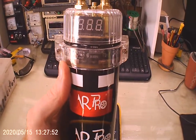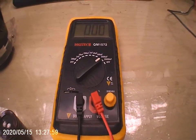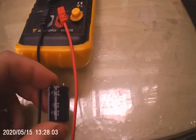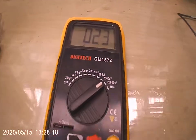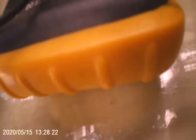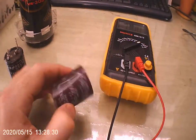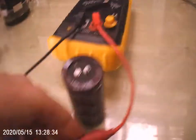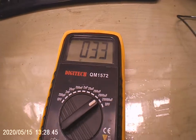Just going to run a quick capacity test on this AliExpress audio capacitor. Here's the meter — QM1572. Just to test the accuracy and verify the meter, this is a 270 UF capacitor. That's coming up at 230. So putting that away — here's a 390 UF. And as usual, that one's coming up under as well.